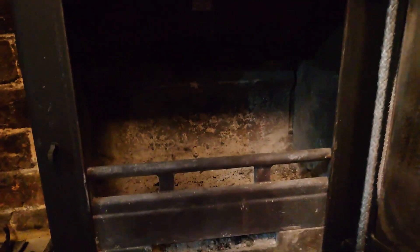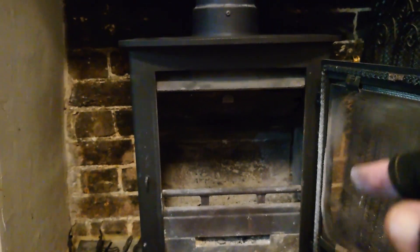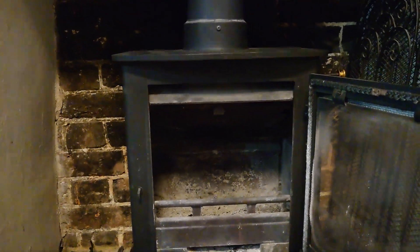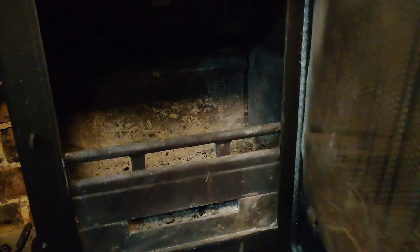You can turn it around the other way, but what I've done with the ashes is I've flattened it all down so you can basically put your finger in there now - there won't be any ash dropping in at all. What you want is a nice one-inch bed of ash in there to hold into position. Open the vent - the air vents are here at the side, it's not going to get in the way because this sits in deeper into the actual wood burner, just enough to allow the air to circulate.